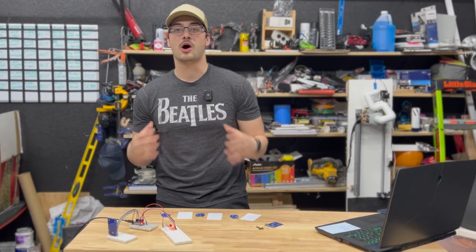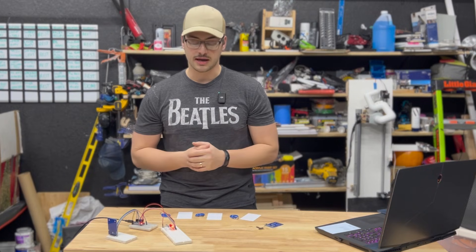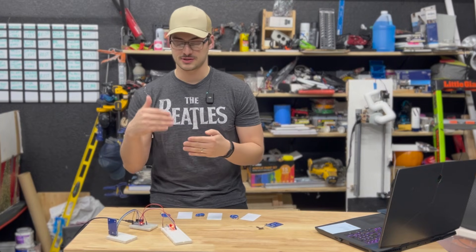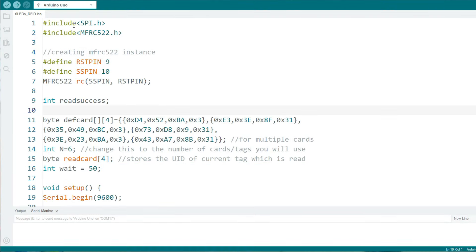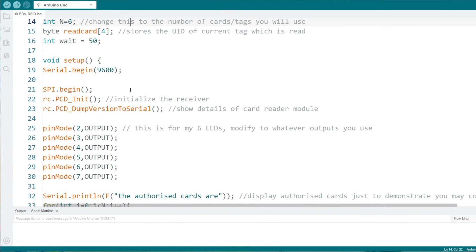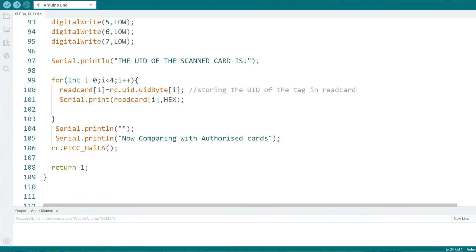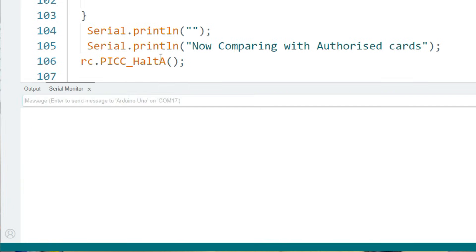Now I want to use the six LEDs to indicate if the RFID just scanned was one of the trusted codes. If it is, I want to light up the spot in the LED bank for that code — so lights one through six, stored in an array with indexes zero through five. The code is very simple: you modify the ReadNUID example to take the scanned code and check it against an array using a for loop. I'll leave the code linked on GitHub below — feel free to grab it, start from that code, poke around, and make it your own. Let me know any questions in the comments.